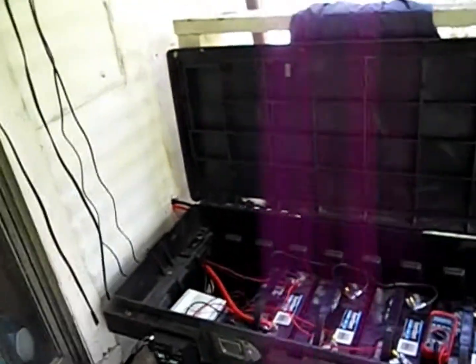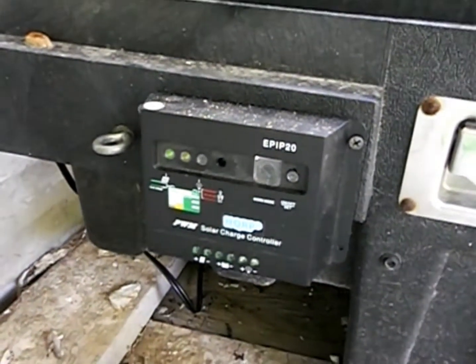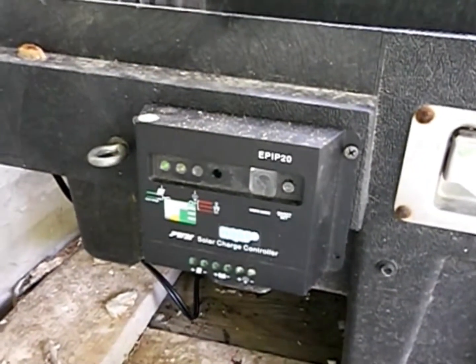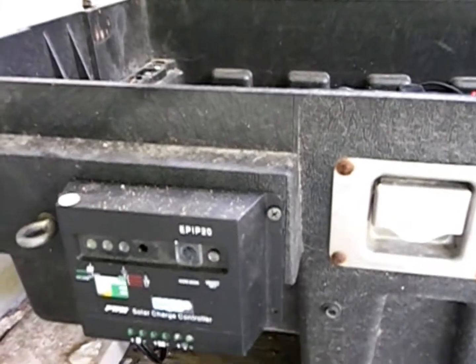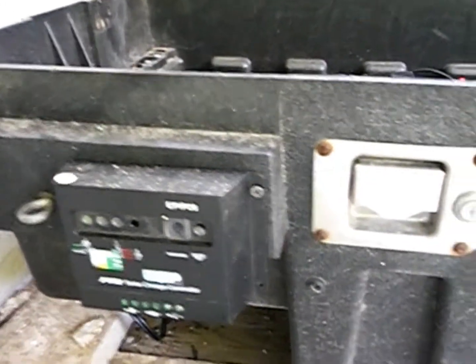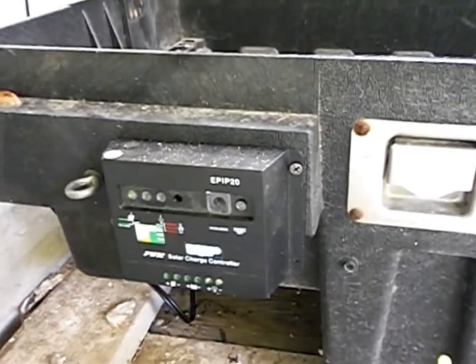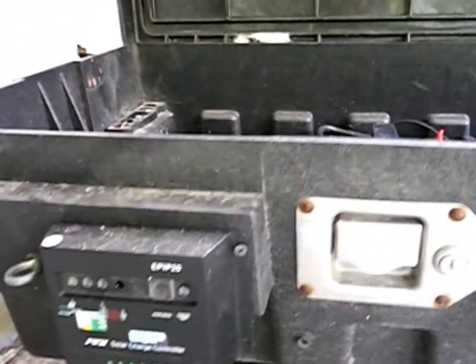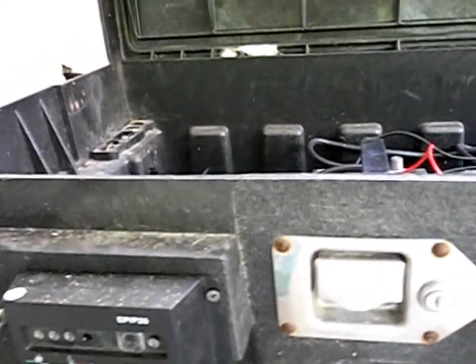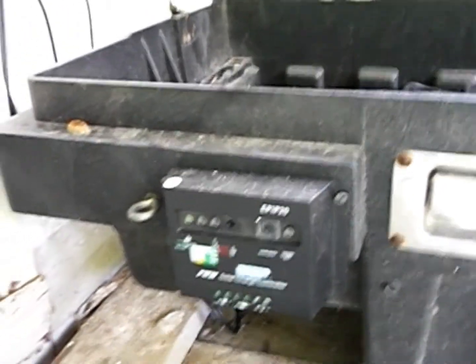Yeah, it didn't seem to matter how many wires I pulled off — it's still overcharging right now. So what we have to do is bleed off some of the power and start again tomorrow with a lower amount of panels. I disconnected eight of the panels and it's still flashing. I thought it was over-amp, but it's not — I'm only producing five amps, five point three, off of this panel system. So it's not too many amps, it's not too many volts through there — except my batteries are at full capacity and can't take anymore.